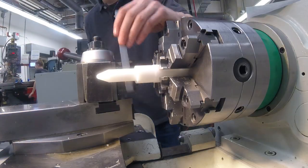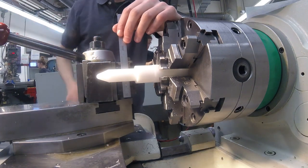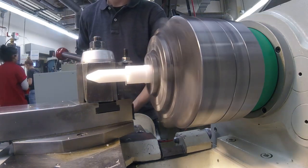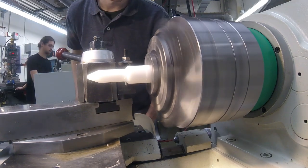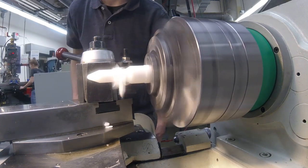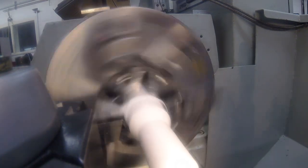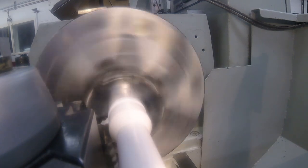Here I put a left-hand turning tool on so I could just plunge it in on that square shoulder between the two diameters, using the angle of the backside of the left-hand turning tool to get a chamfer on there. I only did that for the first one I made — the other two I used the same right-hand turning tool and the compound slide, making a longer taper there. I just plunged in to that diameter and got a nice little chamfer. Now I've got a parting tool in there and I'm driving it forward in X to cut my finished piece off the rest of the raw stock. I'm spraying some plastic lubricant in there, running the speed pretty low, and once it gets close to breaking off, I'm bracing it with my hand.